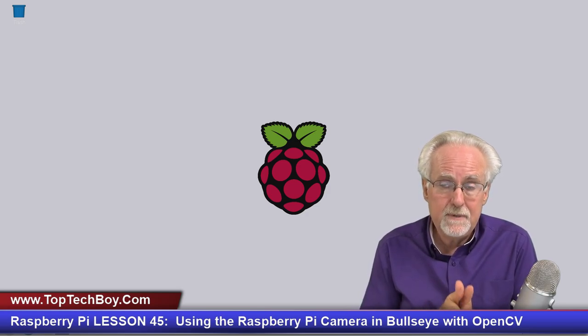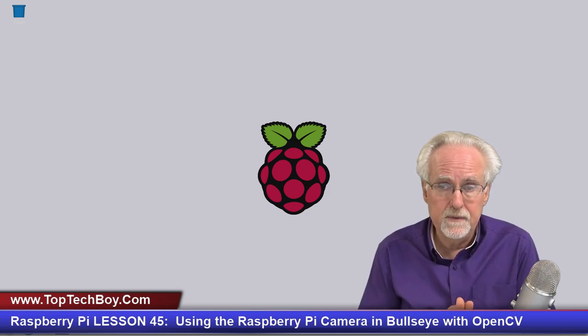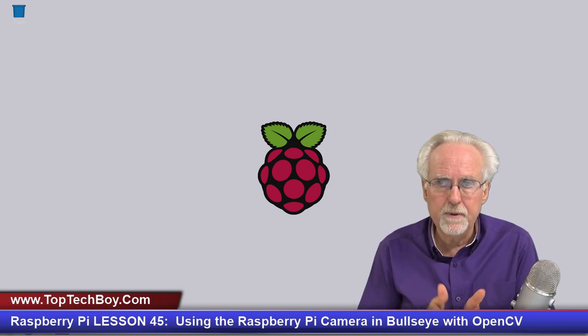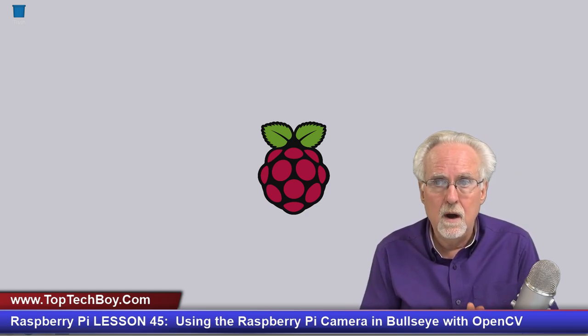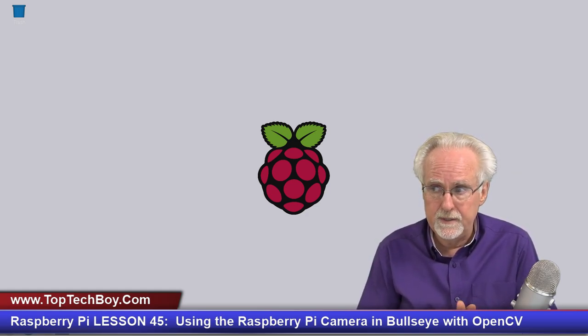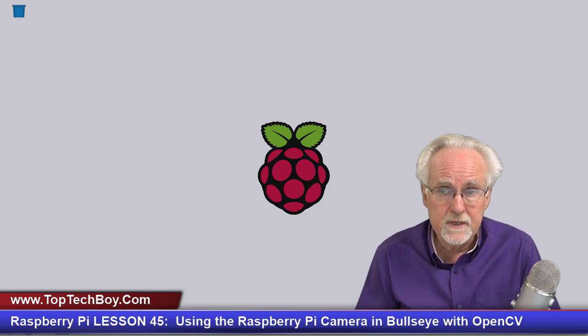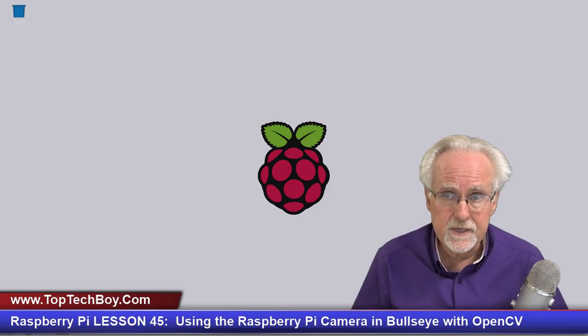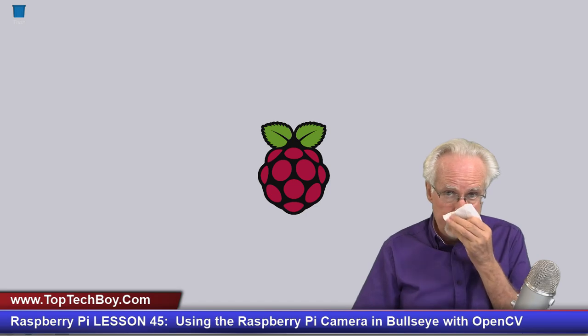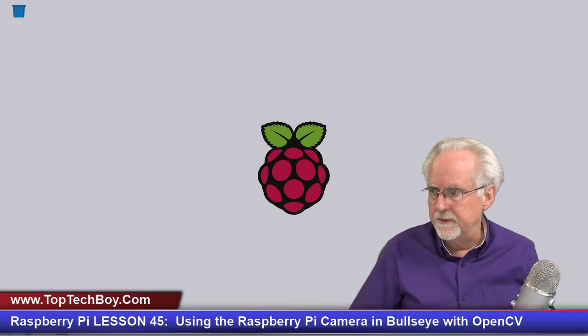Now, the things that I'm teaching you today, if there's some reason that you need to be on the 32-bit operating system, the things that I'm showing you should work on Bullseye 32-bit. But the things that I'm showing you today will not work on the old Buster operating system. So what is it that you need in order to move forward? You need to be on the 64-bit Bullseye operating system. Does that make sense? I hope it does.